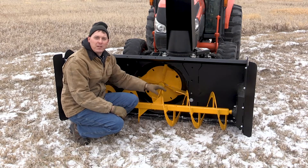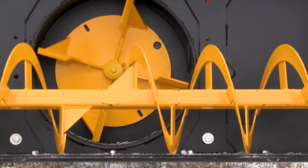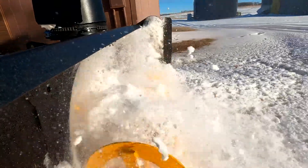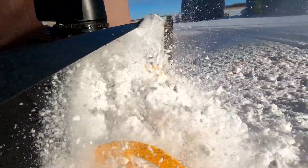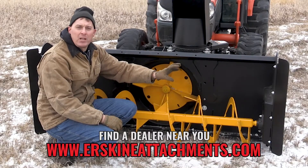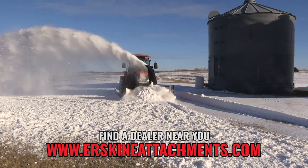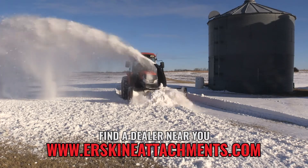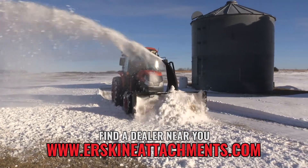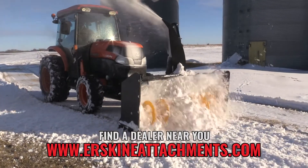I'd like to start by showing some of the features on the front side of the snowblower, starting with the auger. Here we have the 16 inch diameter open flighting. The reason we use open flighting is because it does a really good job of moving a high volume of snow with the least amount of horsepower. It also does a good job of not plugging. This auger is driven on the left side by a chain that's inside of an enclosed case. The reason we do that is because it protects the chain from damage. If you're working in an unknown area where you have possible debris, the debris can get caught in the chain and sometimes break it. Having the chain inside the enclosed case prevents the possibility of that happening and keeps you from having downtime.